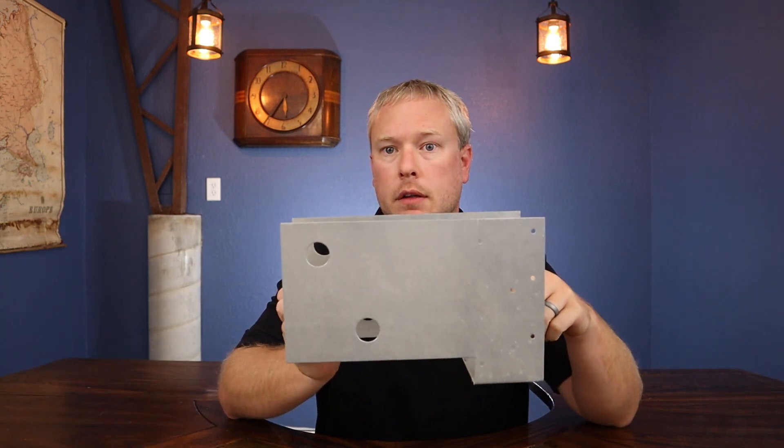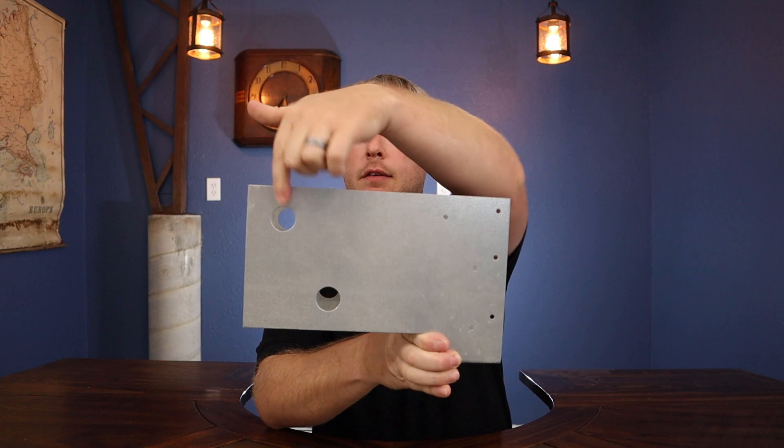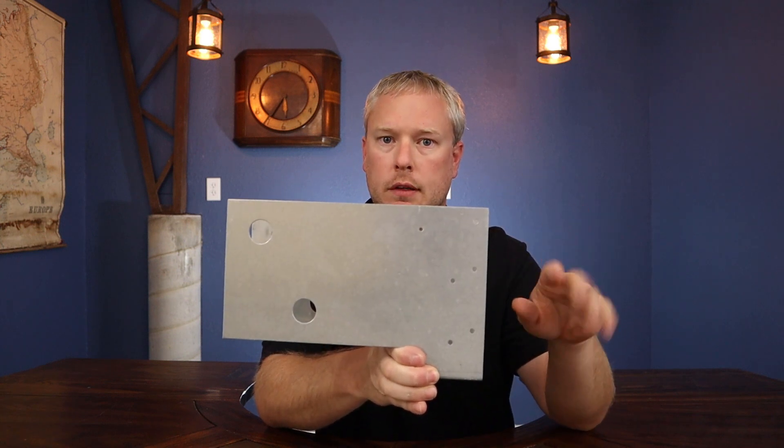The third method — and my favorite, the one I actually used — is using these RP Watkins truss hangers. These actually get embedded into the concrete: the hanger gets set against the wall, and on the back side it has rebar that goes in and gets embedded in the concrete. This is kind of a one-stop-shop truss hanger. As you can see, this one is fairly wide so it takes floor trusses. You can get these in multiple widths for I-joists, regular floor joists, or truss systems. They can also be made at a 45-degree angle — I had to do that with my own home and it worked great.